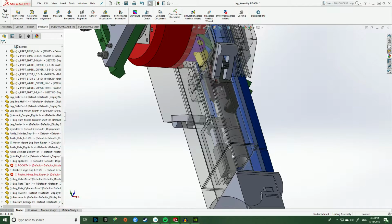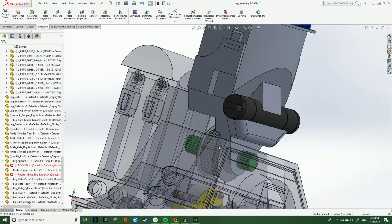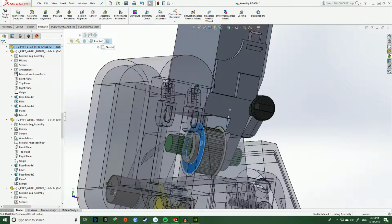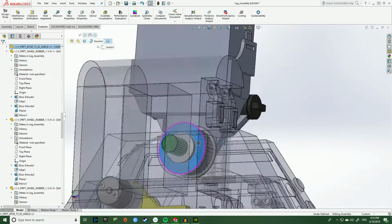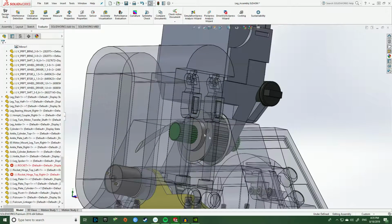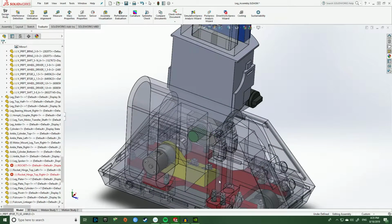So as we continue working our way down the leg here, we reach the ankle. As I said before, there is this belt driver here, which is connected via belts up to the shoulder belt driver. This will effectively enable the ankle to rotate at the same rate as does the shoulder, creating a consistent animation for the leg turn. I'm still working out a few kinks to make sure that it's easy to assemble and easy to take apart when needed. The last bit to talk about for the leg is the drive assembly here.